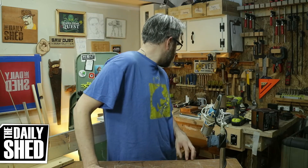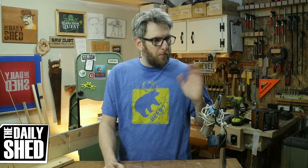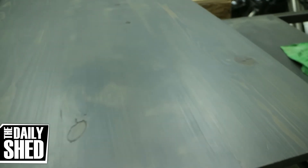I'm going to lightly buff this with synthetic steel wool — quadruple-aught synthetic steel wool. I will buff it lightly, wipe all that off, and then this gets a coat of paste furniture wax buffed in. And that's it, it's done. It's a headboard. This isn't a dining room table. This isn't some piece of heirloom furniture. It's a headboard made out of pine with pocket holes. This is not heirloom furniture. I can get away with being quick and dirty with finishes, and this is one of the ways I love being quick and dirty.